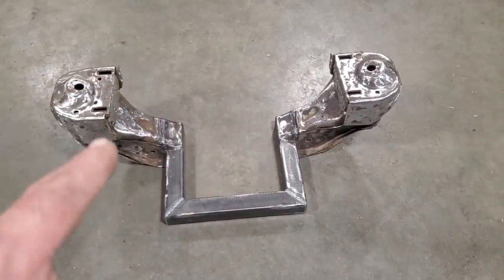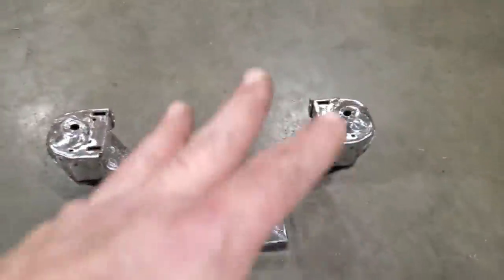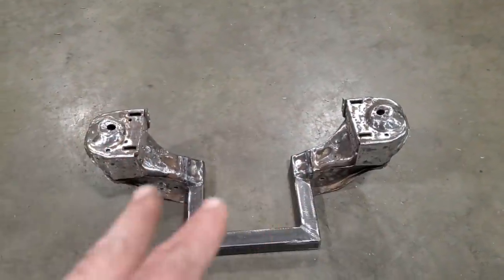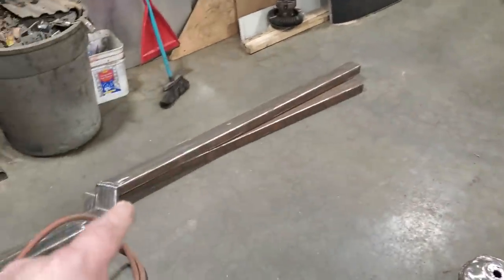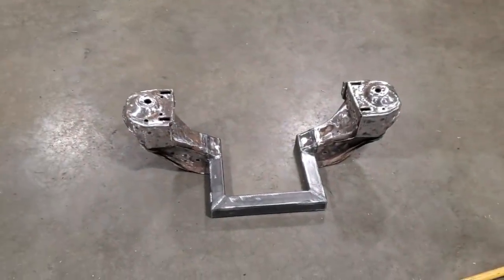That's done there now. What I got to do now is set up these two frame rails to put in here, because I'm going to make this all one unit, welding the frame rails in place, plating them up, doing everything I got to do with them. So it's just a matter of basically taking these frame rails now and running the runners off them to weld them to the body. So the front chassis will be like a subframe, all one piece.